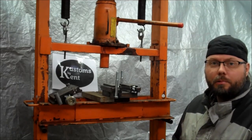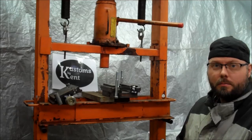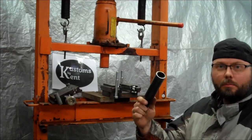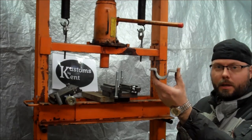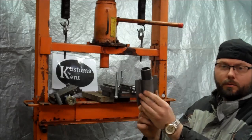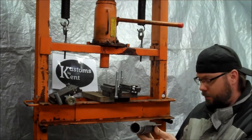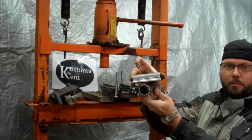Today I'm going to show you the press brake tooling that I made for forming some pieces for the roll cage. This is to bring where two pieces of inch and a half tube come together perpendicular. I made these press tooling to make this U-shaped piece of sheet metal that goes over the tube, and then the other tube goes perpendicular, and a second piece of U-shape goes on — then these two will bolt together.